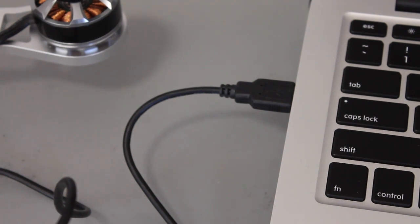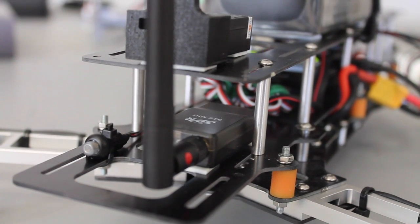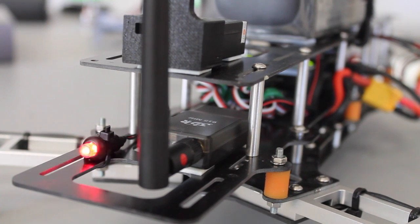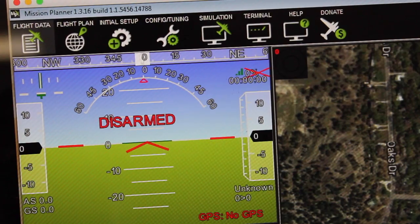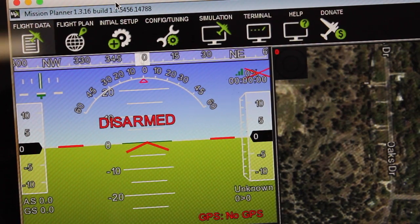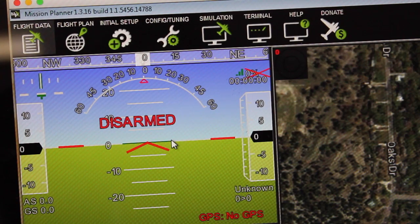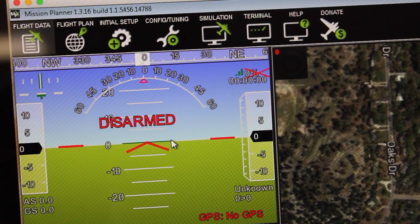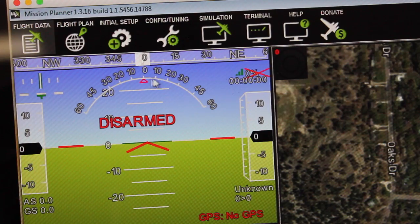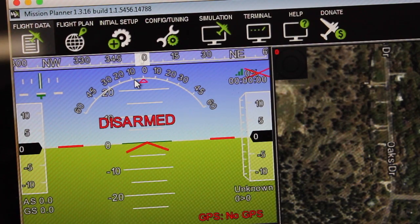I'll go ahead and connect the other end of the cable to my MacBook. You can hear the little Pixhawk jingle. You can see our toggle switch LED blinking. Right now we're getting 5 volts to the Pixhawk from USB and we do not have our LiPo battery connected. I've fired up Mission Planner — I run Windows using Parallels on my Mac. You could also use APM Planner which runs natively on Mac or PC, but I found that the compass calibration sequence within Mission Planner is a lot more robust than within APM Planner, so that's why I'm using Mission Planner.